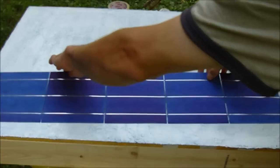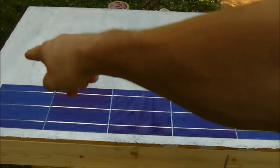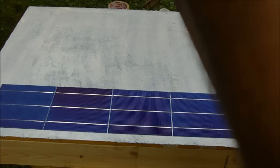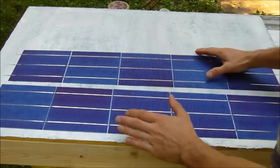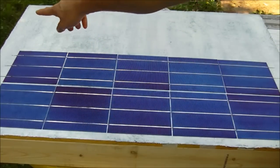I'm just going to lay these down carefully and center them, then grab another row. I'm going to lay a negative — the top of the next row will be negative. Don't let these bend in any way because they will crack — the whole cell will crack. You don't want to do that. So now I'm going to lay on a positive again.